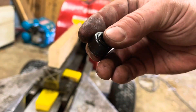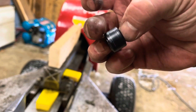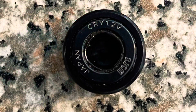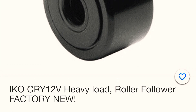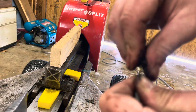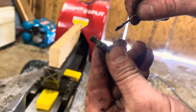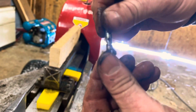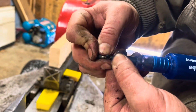Here's the new bearing — I'll give a link to these in a minute. This is a Japan bearing, IKO brand. I think new these go for $11.70 a piece. Here's the picture of the bearing and the numbers in case you want to order any for yourself, and here's the Amazon link. You can buy these in multiples — that's how I would buy them, a few at a time. Here's the cross-drilled bolt that holds the bearing, drilled about three-quarters to one inch so the grease can get to the center of the bearing. I'm cleaning it out with an old drill bit to make sure dried-up old grease isn't going to prevent new grease from getting in. We'll give it a test with a grease gun — just making sure the grease comes out. There it goes, so we know we're good.